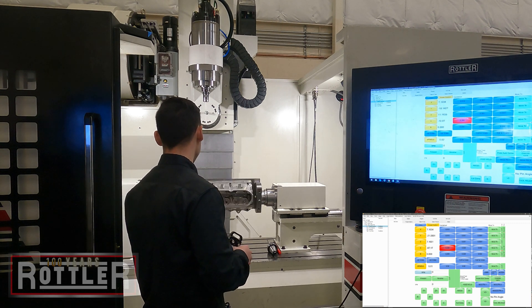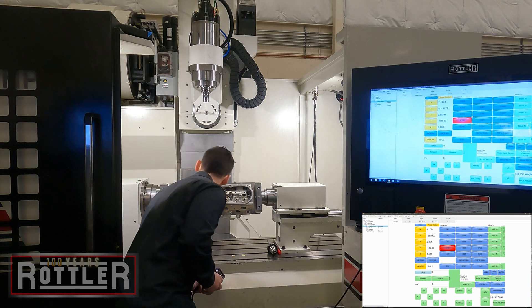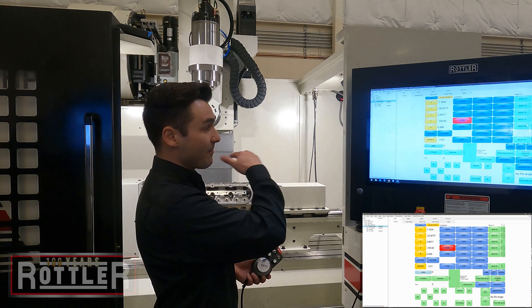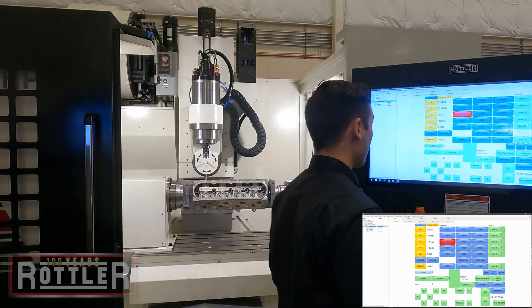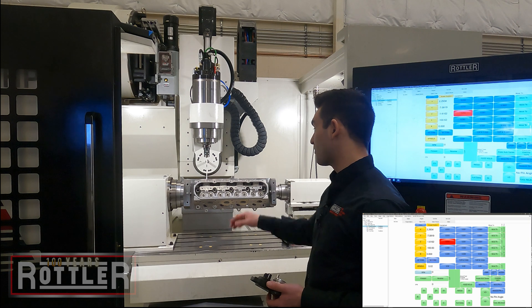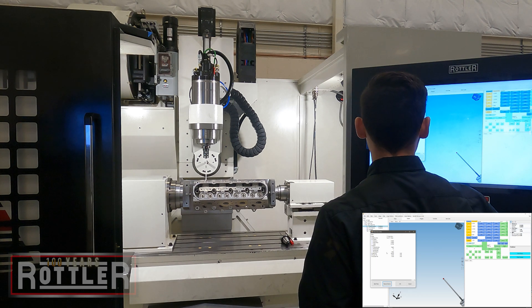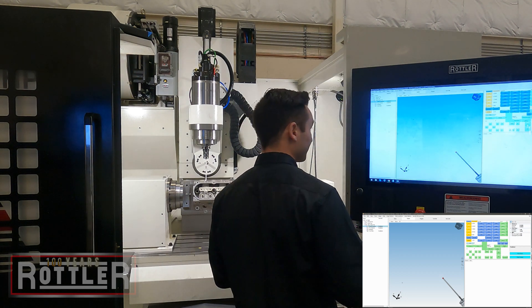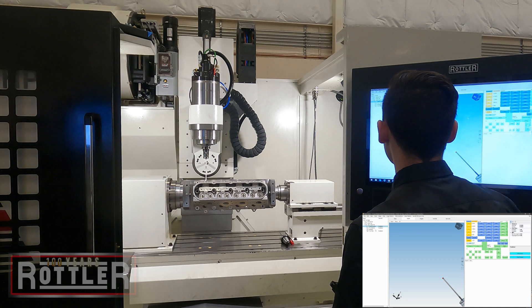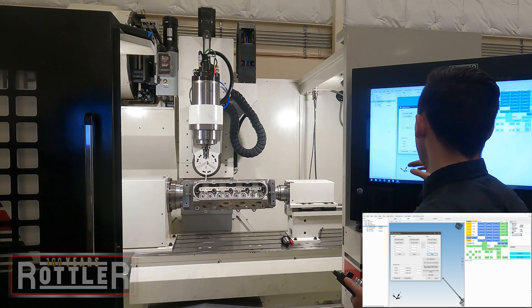We'll start with the manifold side. I've got the probe loaded in the machine and I'm going to probe this manifold surface. You can just eyeball level with that manifold surface sticking up and then jog the probe over. I'm above my first point here and I'll use a depth probing cycle since it's straightforward — just up and down. I'll pull up the probe auto center, use the depth routine, and the machine will move and stop with the probe just touching the surface. I have a port here that I've created and I'm going to right-click on the closed sections and add a new plane, bringing up the plane wizard.